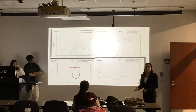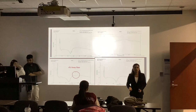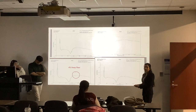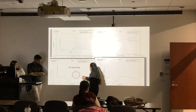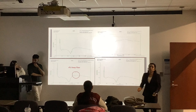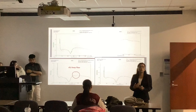These are the DSC results performed at the very last moment of our project. We found that the melting point of the PBAT sample was obviously 130 degrees Celsius — all of these graphs are showing a peak at 130 degrees Celsius. Unfortunately, we are not able to find any peak for hemp fiber in our DSC graph. We can only see a peak at 4% hemp fiber at around 180 degrees Celsius, but none of those have contained hemp fiber clearly. This DSC is also suggesting that our sample is not containing hemp fiber uniformly, and our data might have fluctuated because of not having uniform concentration of hemp fiber.